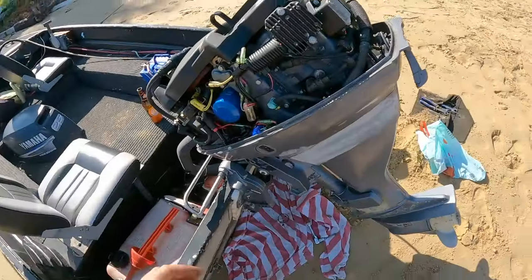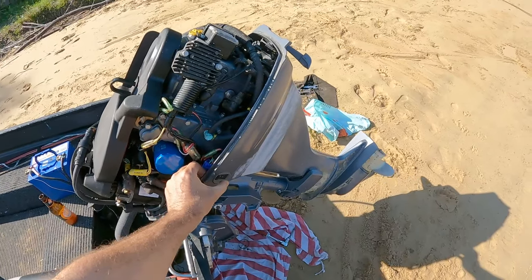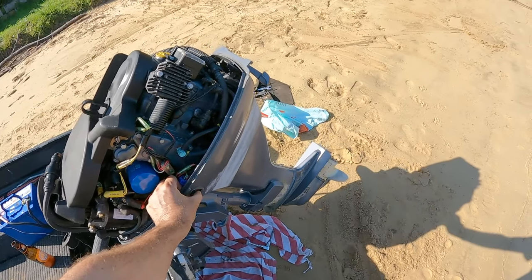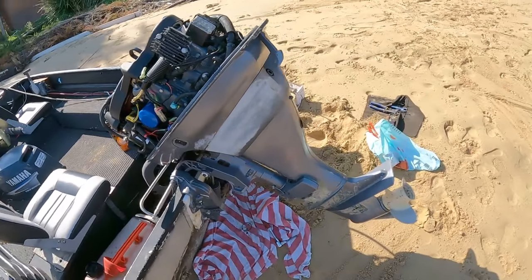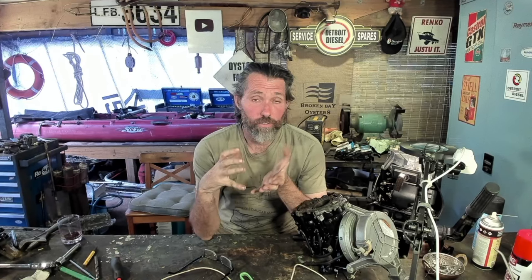I think we're ready for a test — and success! This boat is now ready for its launch and its first test run. It's a relatively straightforward job to change these motors, and certainly for boats that live on the water, they're a pretty common failure point. The hydraulics are pretty robust, so I tend to find the electric motors are what fail most of the time. Sometimes it's the relays, and I do have a previous video on diagnosing this which I'll link to in the description.